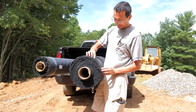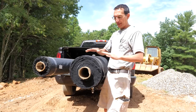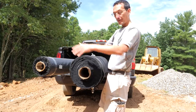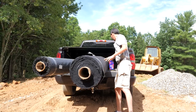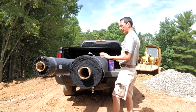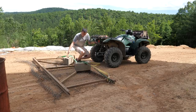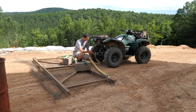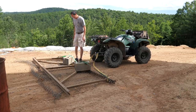This fabric is actually a combination - a non-woven with a woven mixed in, it's kind of fuzzy. In different places on the property where it's really flat we want it to drain more, and where it's sloped we want it to shed water off the crown of the driveway, so that's why we got these different types. The staples are six or eight inch, just pounded in every few feet to hold this down until we get gravel on top. Here's our harrow contraption - a piece of old warehouse shelving, some chain link fence, a couple cinder blocks, and a few ratchet straps. Hillbilly engineering and it works pretty well.